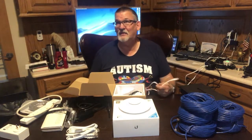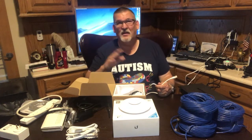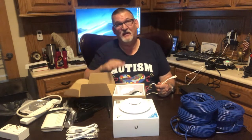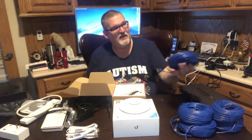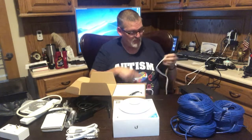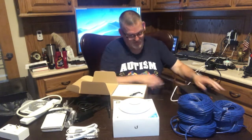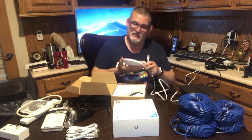The only thing bad about Cat6 is after about 150 feet, you start losing your speed and you end up being down to a gig anyhow. This is Cat5e, good 100 meters, 300 feet, 328 feet. Guaranteed to give you a gig all the way through. So, plug this into one of the PoE ports, and then I can take this,